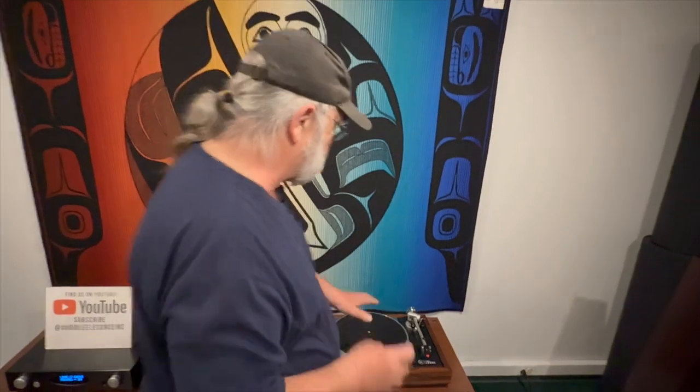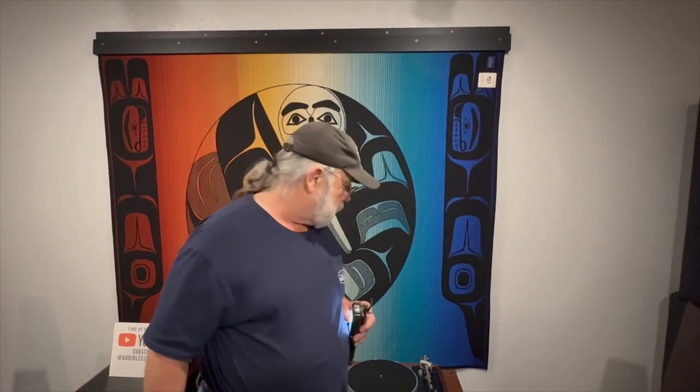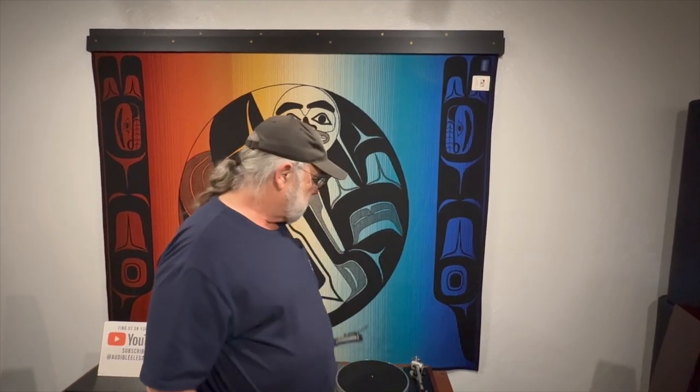So if your platter is going up and down, but you see the arm board twisting, wrong. Back to square one, so to speak. So next time I'm going to have this table opened up. I'm going to show you it in a little more detail in terms of arm dressing and what's happening with the springs. So you have a little clearer picture mechanically of what's going on. But in the end, this is the result you're shooting for.